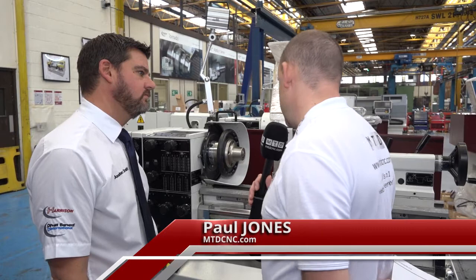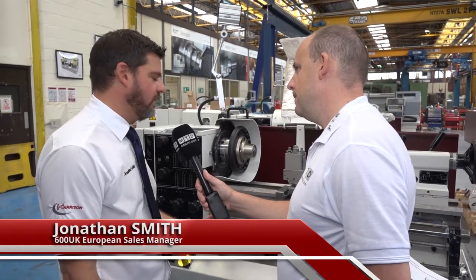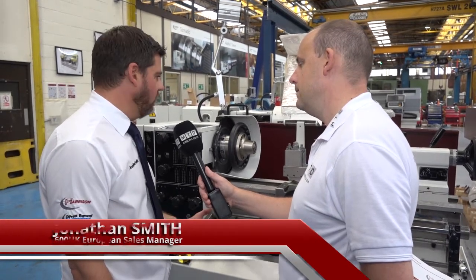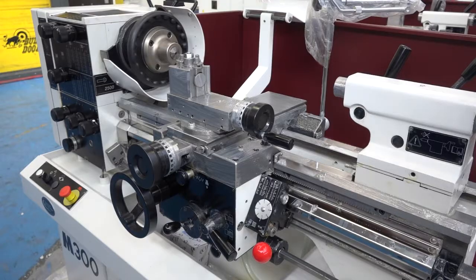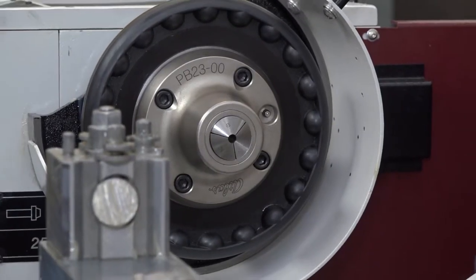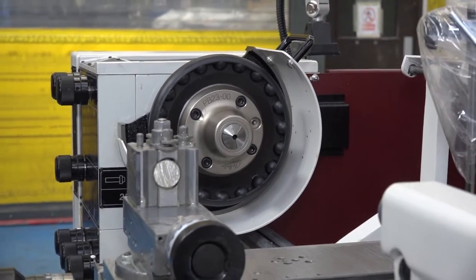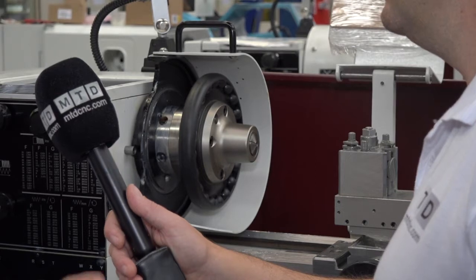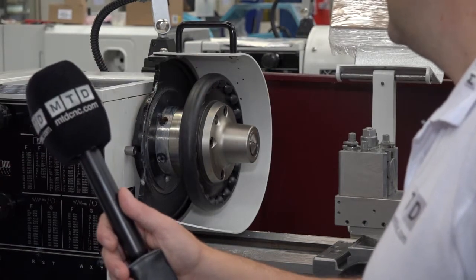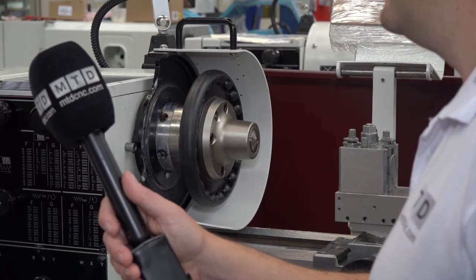I see a lot of work holding systems and chucking solutions — this one looks a little different. What is it? The normal solution for a collet chuck on this size of machine would be a keyed operator collet chuck, but this one is a new innovation we just started supplying. It's what we call the wheel chuck. It takes standard 5C collets and without having to use a key, you can lock it with the mechanism at the side here — so you don't have to go through the rigmarole of tightening it with a key.